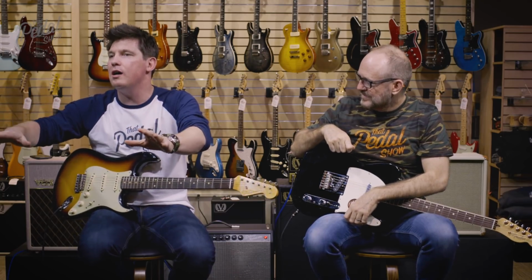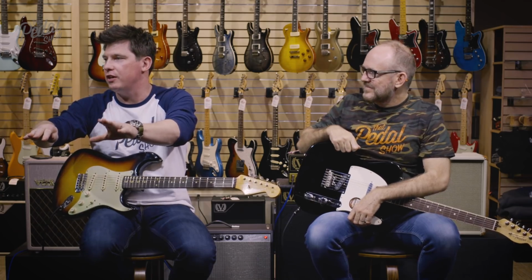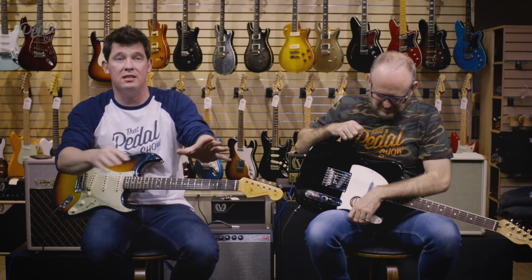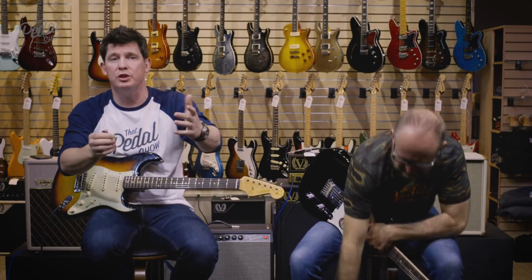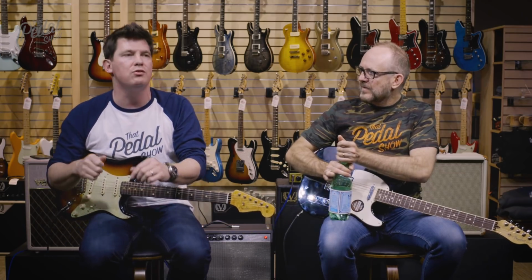Okay, but that's why if you've got your buffered bypass wah-wah and a traditional fuzz, it hurts the fuzz to come after the wah. When you step on the wah, all other crazy things happen. But even before that, that's exactly what's happening there. And that's the most common question about fuzz, which way around with the wah and the fuzz. Some fuzzes, we should say as a caveat, are kind of engineered for this and designed around it. We're talking about vintage style fuzz faces specifically, and other vintage style fuzzes, particularly if they use germanium transistors.